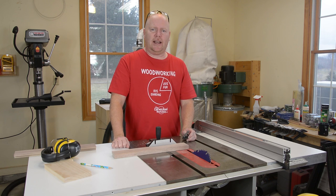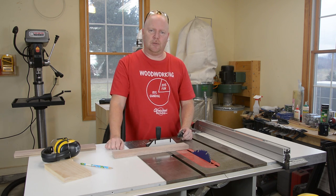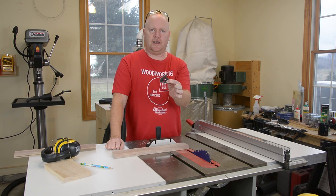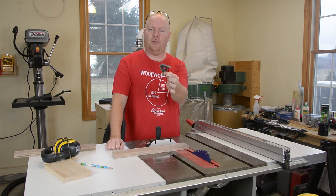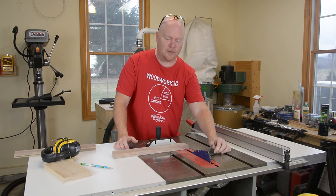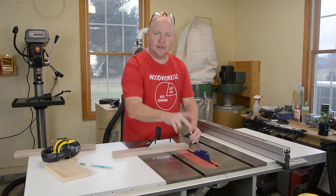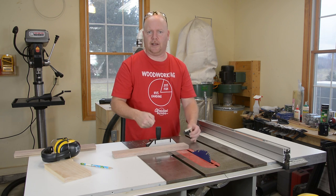The most accurate way I have to cut 45-degree angles on the ends of pieces is to tip the table saw blade. I set it using the iron piece of my Starrett little mini square — this is a pretty exact 45. Crank the blade up, set it against the flat spot, not the teeth, and then put it back down where you need it.